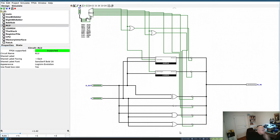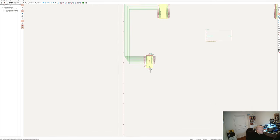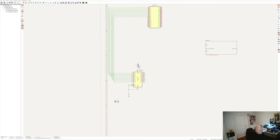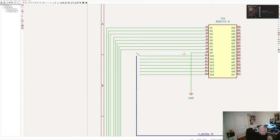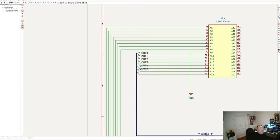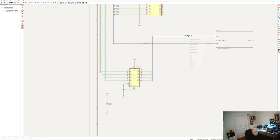The rest of the ALU is a little bit more interesting. The ALU accepts signals like X out, Y out, and X, and emits X in plus ALU control signals. The X out signal comes directly from the X register, and in the physical design I'm going to buffer it to decrease the fan-out load on the X register's output buffer. For Y out, it's only used by a couple of modules, so the fan-out load won't be bad and I don't need a buffer there. After splitting the buses and combining the output of the buffer back to the bus, I can connect it to my header.